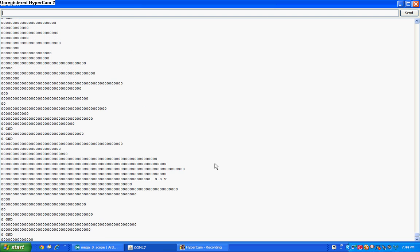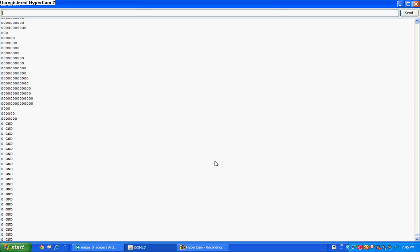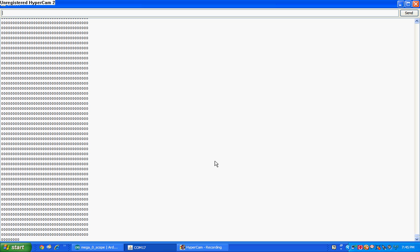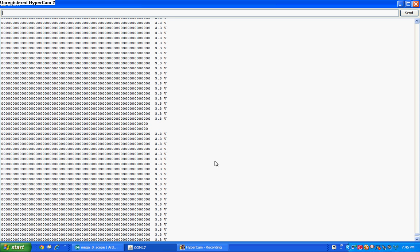Right now it's just floating and I'm tapping it with my finger. I'll put it on one side of an LED to see what voltage that gets. So that side of the LED is at ground. Now the other side of the LED is at that many zeros. If you want to count how many zeros there were, you could figure out the voltage — because each zero represents a hundredth of 5 volts. So to find the voltage, count the zeros, subtract one, and multiply by a hundredth of 5 volts — which I believe is 0.05 volts — and you get your voltage.